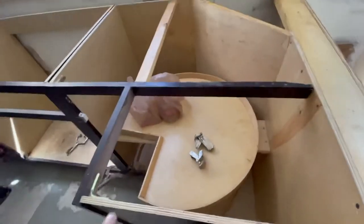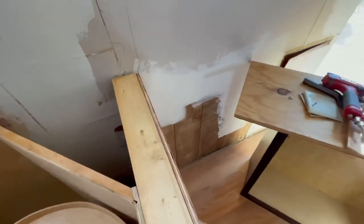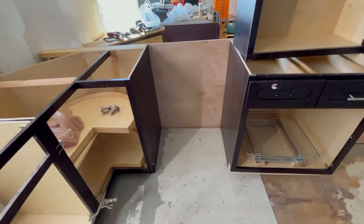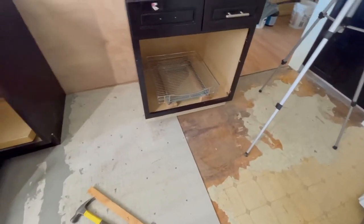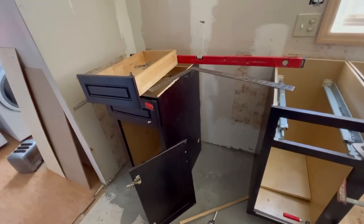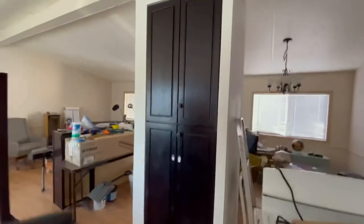On this lazy Susan, I put a two-by-four all the way to the back because I knew I'd have to back it with something. The dishwasher goes here — always keep your 24 inches. Then this will be the end cabinet. I've got to put HardieBacker back around underneath there. Main thing is I'm trying to get these folks water today — hook back up — and the oven can slide in for a moment. This is an inch-by-inch kitchen, but for the price it's going to turn out fantastic.